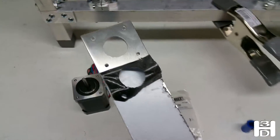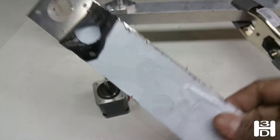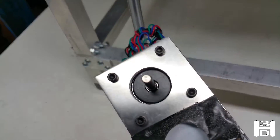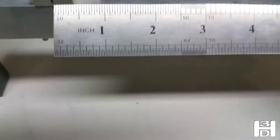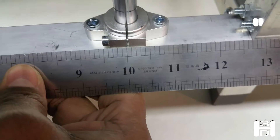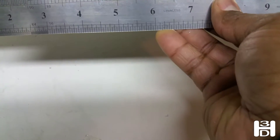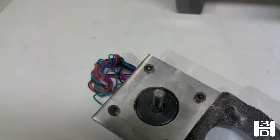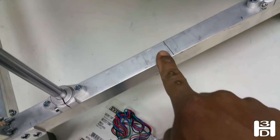We drilled out the mount — I haven't cut it off the rest of the aluminum yet. It's mounted on there; I just put the screws in finger tight. I'm placing this just at the edge of the opening for the rod mount, and at this rod mount it's exactly 10 inches. So we're looking for 5 inches as our center point — we want to mark that spot and line up the shaft with that 5-inch mark.